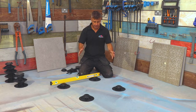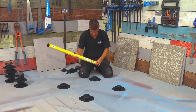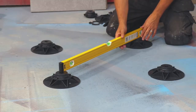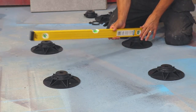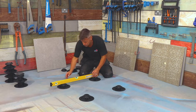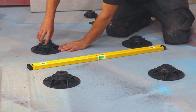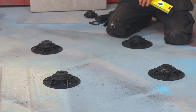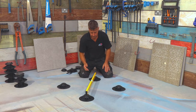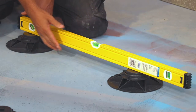To start with, for the very first slab, I'm going to place four of the base sections here. I'm going to take my spirit level and start at one point and make sure all three of them are actually level. The floor doesn't have to be level here — if we get a starting point, we can rise that up and down, checking that we've got that level there. Do the same on the opposite one, and then the same on this one.